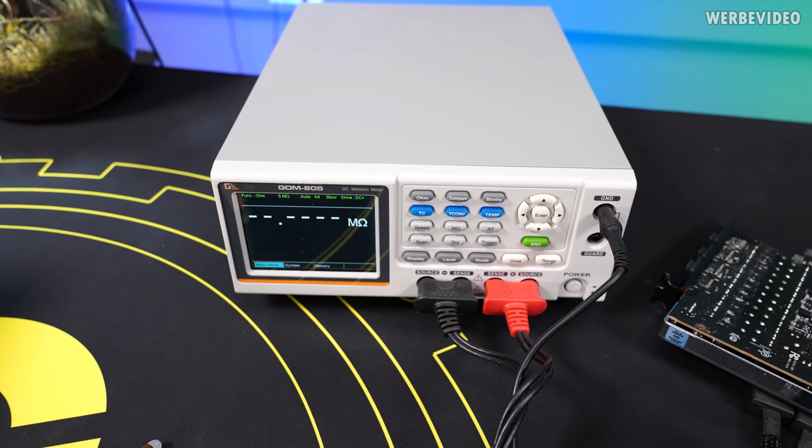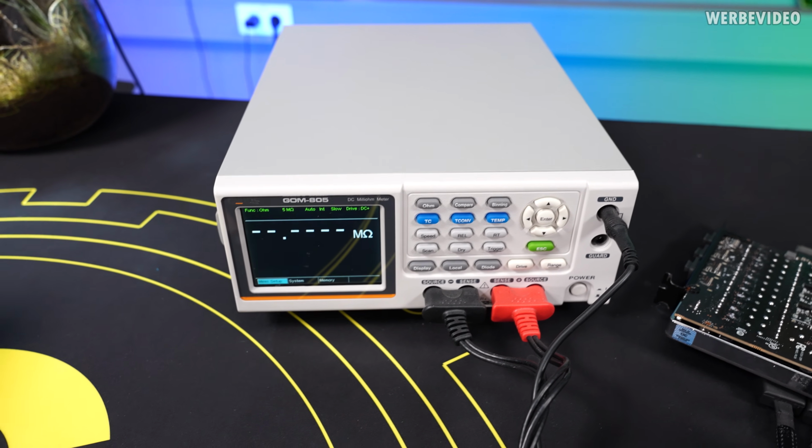But I also want to highlight that measuring this now is only helpful to a certain degree, because it's obviously not the situation prior to when the connector melted. So we definitely changed something. That's firstly, if a pin melts, then you have a physical change inside the connector itself. So the pin inside can move once the plastic is a little bit more soft or liquid.